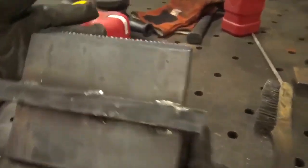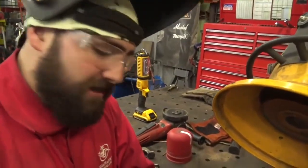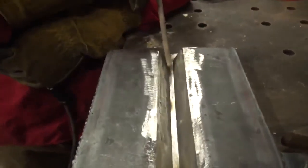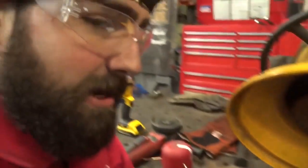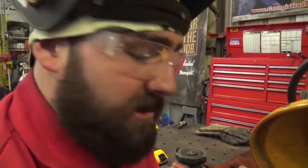Small tacks — this fit-up side is the most important. Once fit-up is good, tacked on top and bottom, wire brush and clean all BBs and slag out, and you're ready to go. Rod angle varies between welders; I like to angle my rod down a little in my stinger for control. The goal is to have both plates fuse into the backing strap — to do that you need to manipulate the puddle. These are drag rods, so drag it — do not push. Pushing causes the puddle to jump in front of you, trapping slag. Drag it all the way through and hopefully we'll get through in one rod.